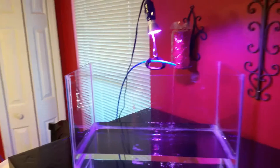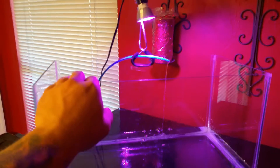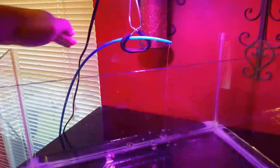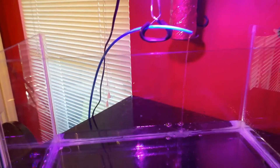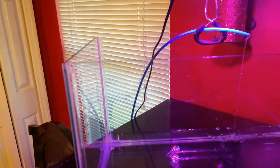Filling it up now — looks pretty good so far. After sanding the top edge to make sure I don't get cut, I used a razor blade and buffed it out with the cerium oxide to help get a good finish. The cerium oxide actually helps get rid of any scratches I might have caused with the razor blade. The edges are still a little rough though.